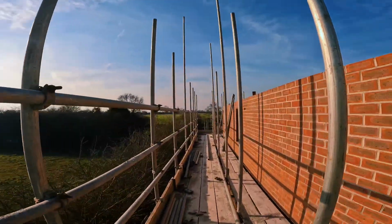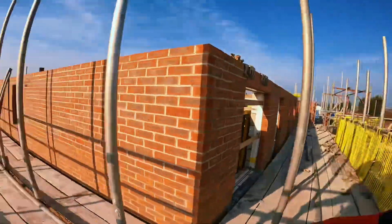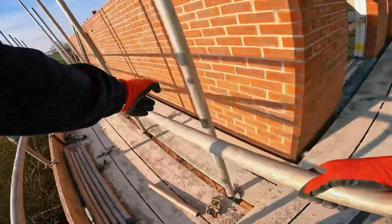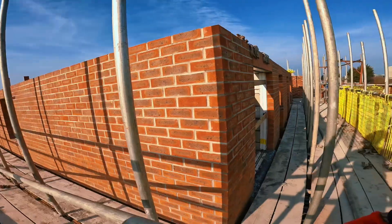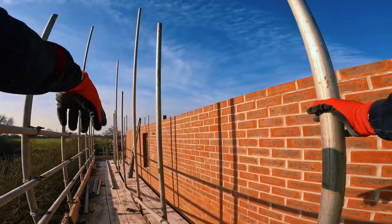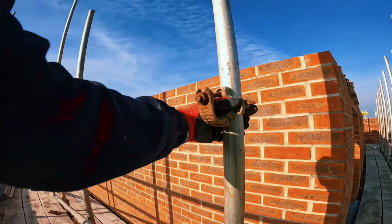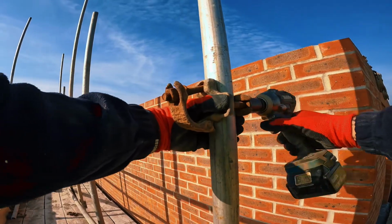Now, let's run this ledger back this way. So I'll start my long from here now. Like I say, this one goes into this bay here if you can see that. Slow reach here. Bang a dub here, bang a dub at the end, both ends first. Pick the middles up after. Let's have ya. Stick it on, roughly same height as the outside ledger. Level it with 5s in a minute.